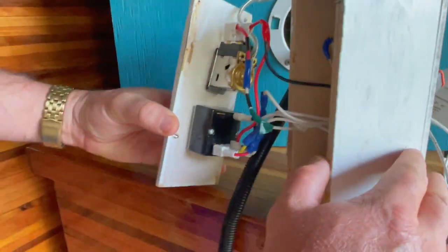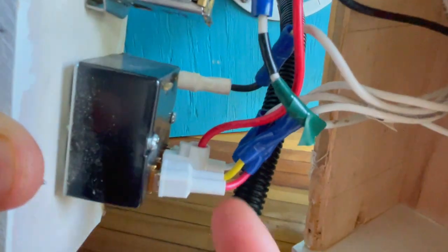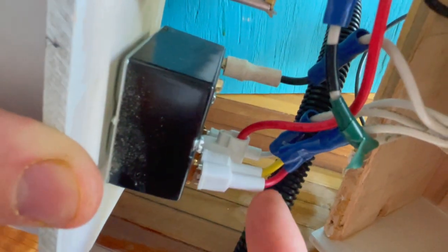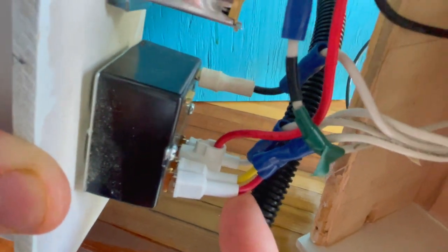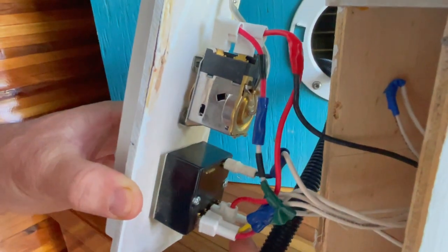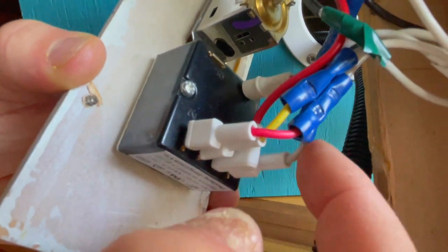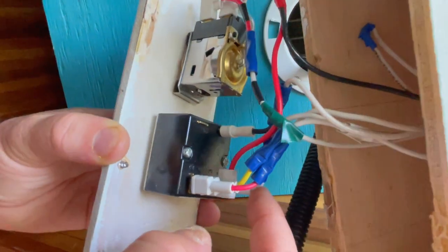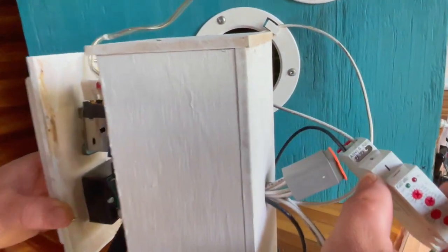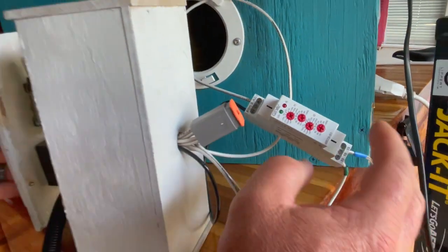For our neutral, we picked up the white wire for the entire controller. Inside the box I only had a white, a red, a yellow, and another red, so our neutral wire was the white wire at the bottom. I cut right into that wire — that's where I got my neutral wire that ties into A2. That's the power side that's going to power the module.